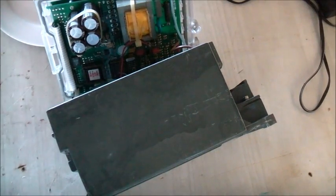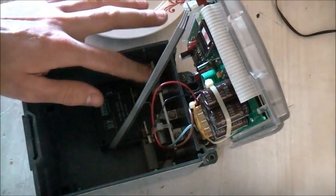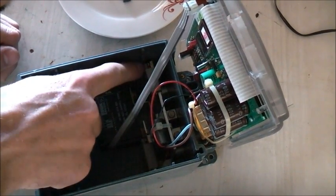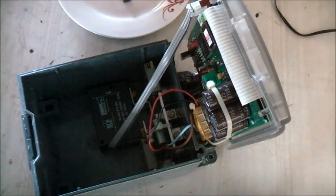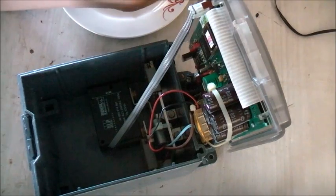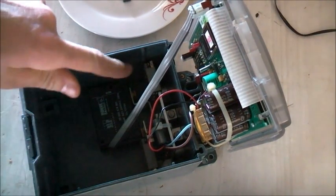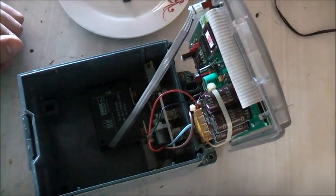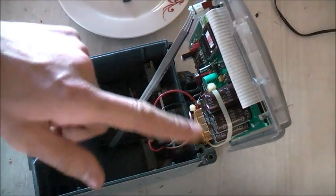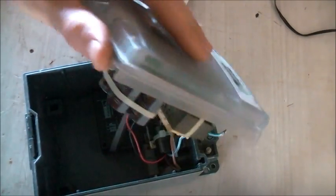You can smell it. There's like a little bus bar — ooh, that's hot. Almost melted that zip tie completely off. There's a little hall sensor there. I wonder what my big PFC capacitor will do. It'll just be a dead short through that one little bar — completely dead short, so it probably won't blow up. I'll have to put it through the power supply inputs — the active and neutral — to simulate a massive power surge. That might get some spectacular vaporized components in there.